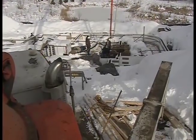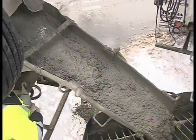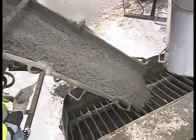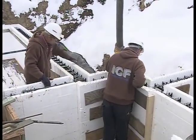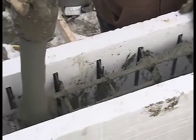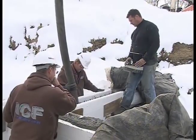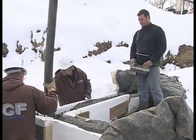Did the snow slow you guys down at all? No, just shoveled it out of our way. We were very concerned about temperature — we couldn't pour yesterday because it was just too cold. Today we're ready to go. The concrete has got to come out of the truck at 55 degrees or more. Although it does warm up once it starts to set — right, the concrete curing process generates heat, so once we get it in the ICF walls and get the walls covered, it generates heat — perfect environment for concrete.